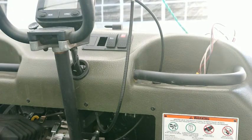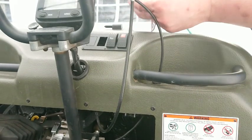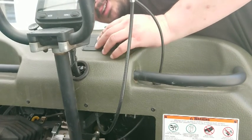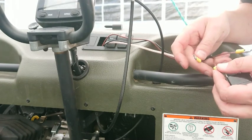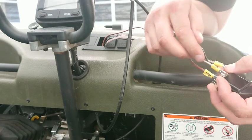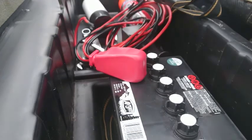I'm going to thread our wires through from the back. Remember: wire number 3 is brown and the negative is the opposite side. This is loads easier than a car dash. Number 3 is brown and black is the complete opposite, which means positive goes to the middle. Now I'd better run this back to the battery temporarily and just check that it's right. Our wire with the white trace was what we were using for negative - let's just touch these on briefly. That was a zap - something's not right. Let me go back over my footage. I had misread pins 3, 4, and 8 - that was my left eye being a little bit dicky. Let's try now. Our pump runs and we've got our switch right.